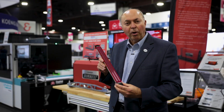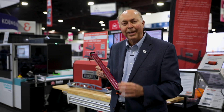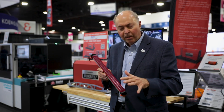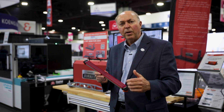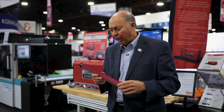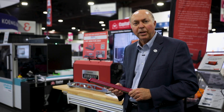The unit itself, at the heart of it, is driven by a printhead that has two strips of silicon. Each strip of silicon actually has five rows of jets, making a total of ten rows of jets at sixteen hundred DPI each. So we essentially have a 10x redundancy, which helps allow long runs without the typical implication of paper dust and fibers shutting things down, adding to reliability. This is a monochrome system, able to mount on presses and run at high speeds.